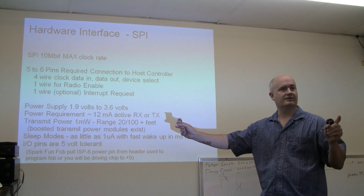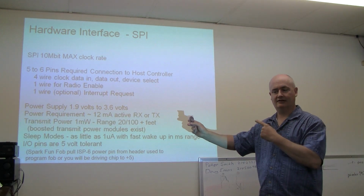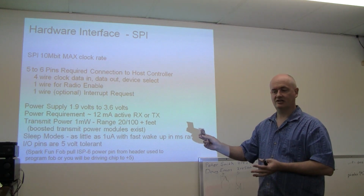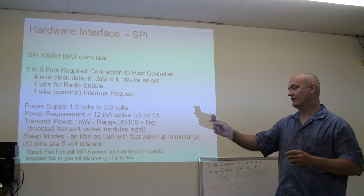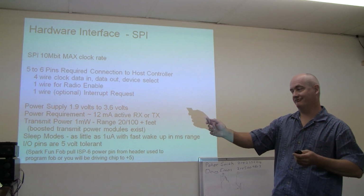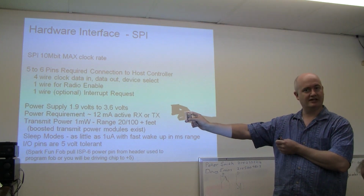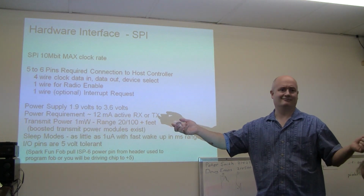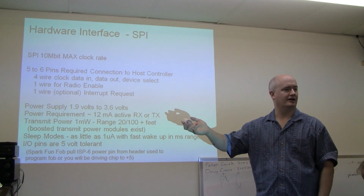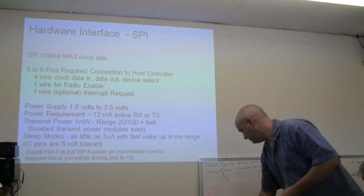And it's drawing on the order of a few microamps. I don't know exactly what the Tiny24 draws asleep, but I know this, the radio chip, when it's in shutdown mode, it draws a microamp, which is nothing. So whatever the Tiny24 is using, almost nothing. There's a coin cell powering it, and in this case this thing can sit around for a year, no problem, and be used many, many times. So anyway, let's move on.